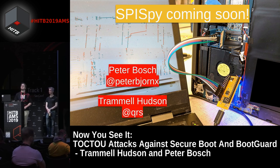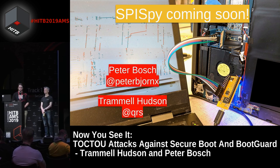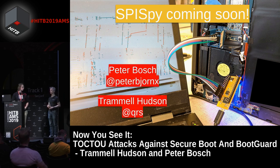Hi. I have a question. Is it possible to use the same technique, for example, to hack into a hard drive firmware rather than ROM? So most of the hard drives are running ARM or RISC-V CPUs. Many of them have on-die boot flashes. However, a lot of the OEM code is not particularly high quality, so I expect it would work for many hard disks. We've certainly seen it works against ARM-based BMCs, so we expect that we could extend it to many other ARM devices.